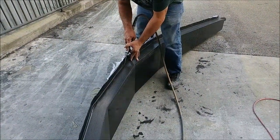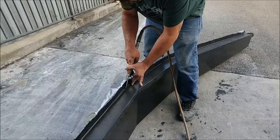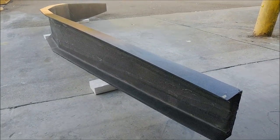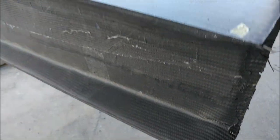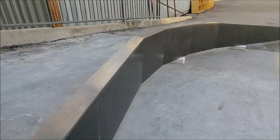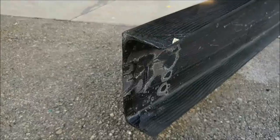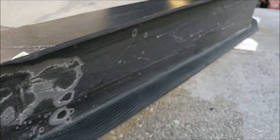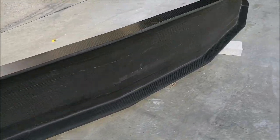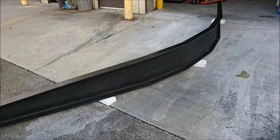You can't go around corners with the router, so Jeff has to finish the last bit of the transitions by hand with a small air reciprocating saw. Here's the finished product — apart from still needing to trim the ends a bit, it's looking super nice. The next steps are to sand the top and bottom flanges and the back face where the spar will meet the wing skins and aft bulkhead, then put it back in the mold to drill the holes for the wing mount bolts and gear mounts, which will also serve as indexing points for alignment.